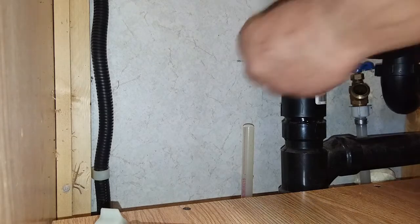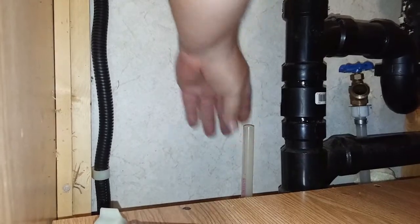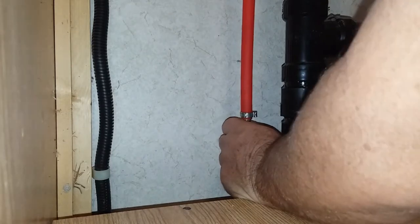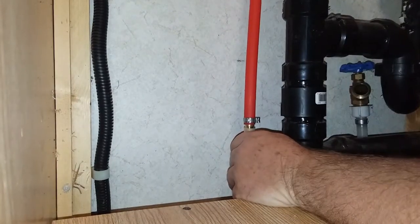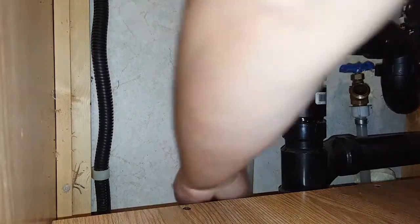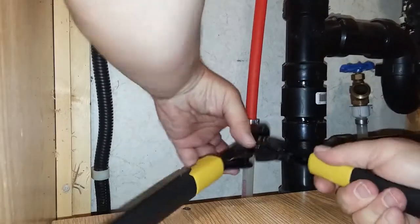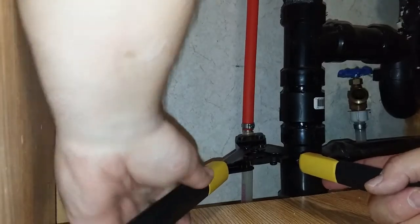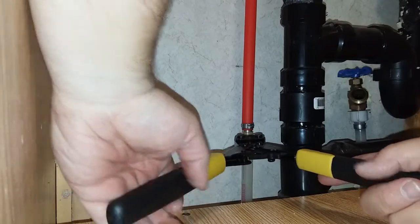To raise the valves up so they could be reached from the top of the washer, I turned the water off and cut off the hot water valve. Then I added about 30 inches of PEX — that's P-E-X — tubing to the original tubing. I had to use barbed connectors with pinch clamps to do this work. The tool for pinching these clamps wasn't cheap, but it worked so well that I feel it was worth every penny.